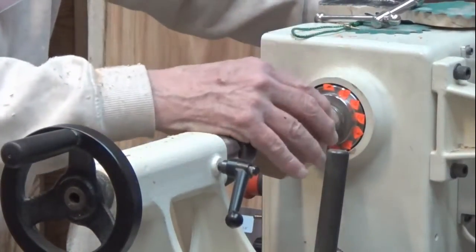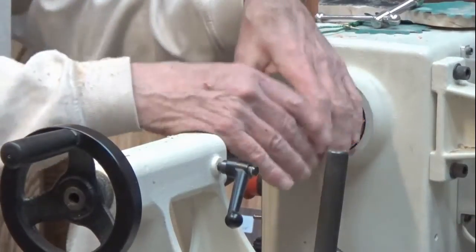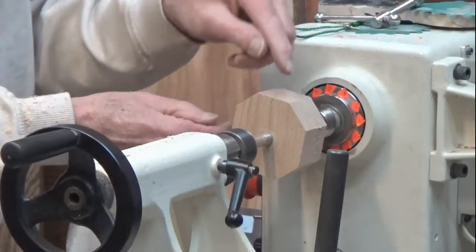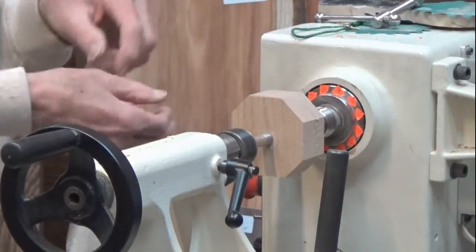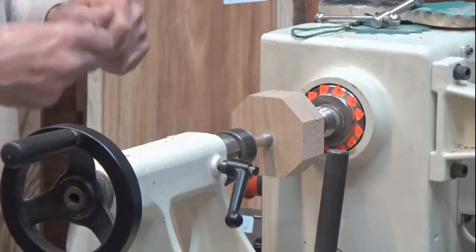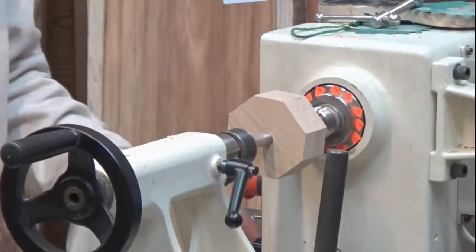You'll notice it's not square. I take the extra time on the chop saw and just cut the corners off, because if it's square, a lot of times when you first go in with your tool, it will catch the first corner and it will splinter. And then all of a sudden you stop and then you'll get the tweezers and you're picking splinters out of your hand. Sometimes when I'm doing oak, I wear gloves,